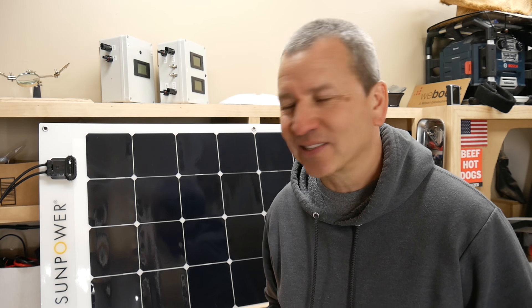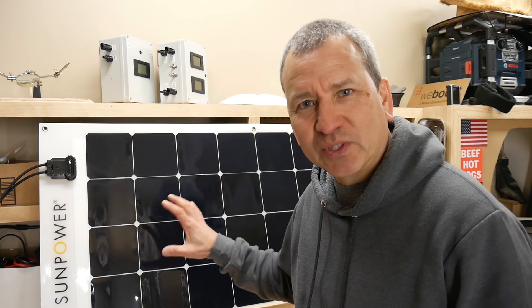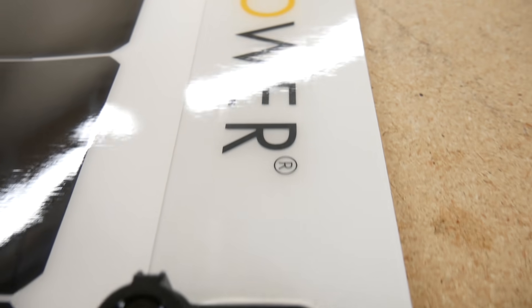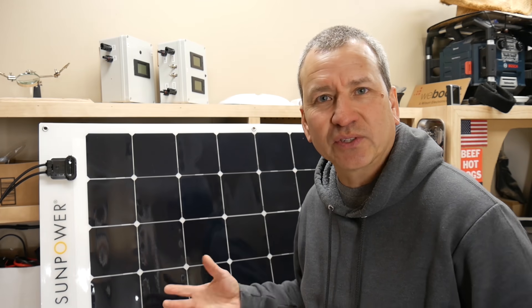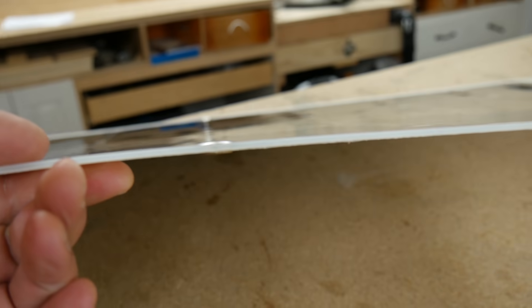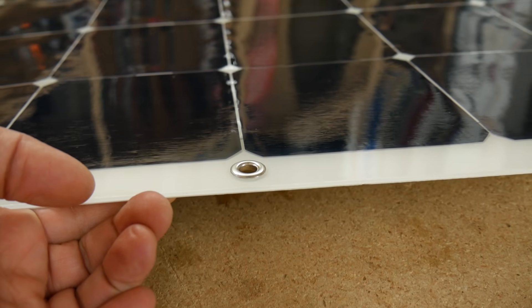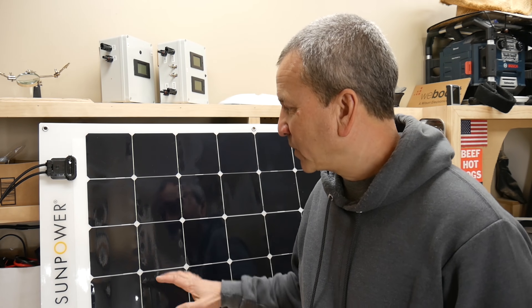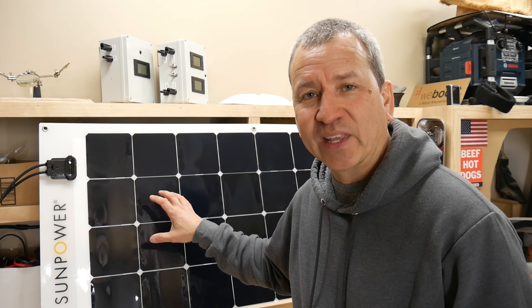I've been in contact with SunPower off and on for the last few months, but it was before the holidays, before winter — not a great time to do solar panel testing. But I really wanted to get my hands on these so I could do some testing and share it with you. At first glance, you're probably wondering what's different about these. It's got a slightly bigger space for the branding and their junction box, that's about it. The number of solar cells is really similar to other 100 watt flexible solar panels, and the thickness is about the same. It's got the same number of grommets for mounting. But what's really setting this one apart is, obviously, they say it's 110 watts — we'll talk about that in a second. But it's really the type of cell in this panel that is the difference.